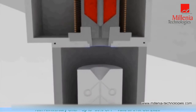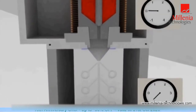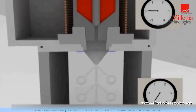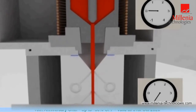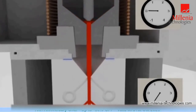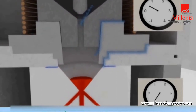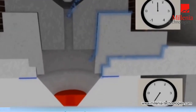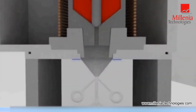During normal use at one, maximum two bars, the applied gas pressure above the crucible can only act on the metal once the mould is occupied, by jetting through the crucible feed hole to the underside. The effect of this pressure is drastically reduced by drag of the crucible holder. In fact, application of gas overpressure by this method shows no significant advantage over a simple gravity vacuum system.